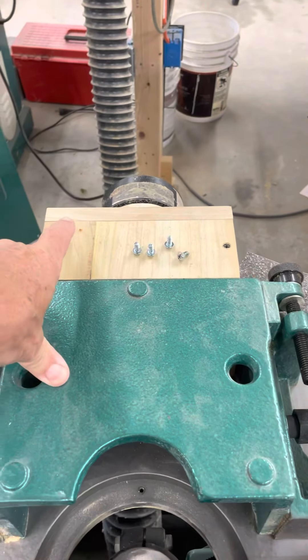How you do this is you take your fences off because they'll get in the way of removing the throat plate. You'll take the three screws — there are three screws in a triangular pattern. You'll pull that out and be able to take all these inserts out with the tabletop so you can gain access to look at what you're doing. I found it easier to do this with a dial indicator because I want to see the movement. I have a bit in there and used a piece of wood just to gauge it.